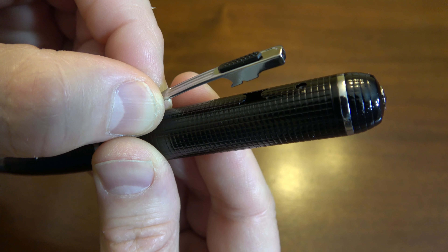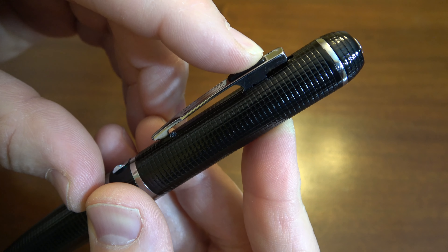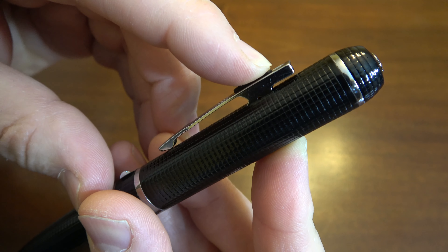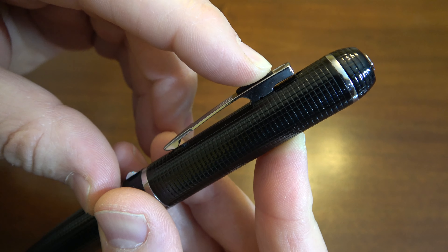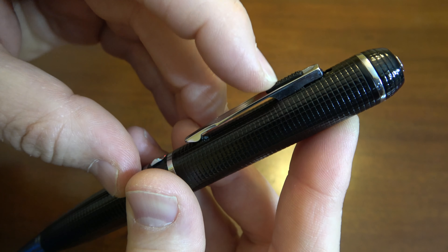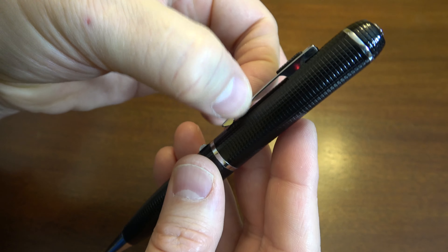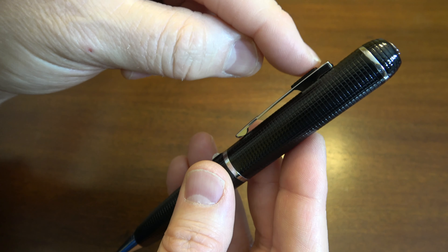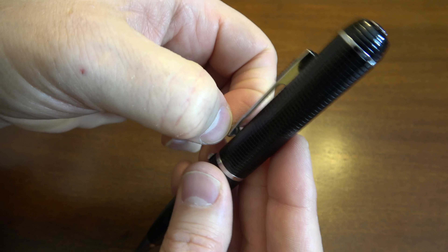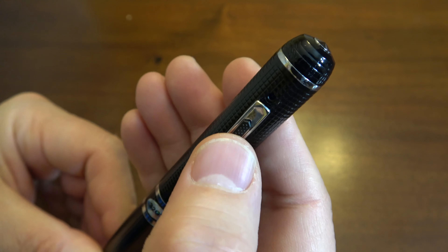Take the metal clip and the pen and set the clip gently into the rails where it's supposed to go — just right over the slot, holding onto it with tension to keep it in the right position. Now just push down on the metal clip. The metal clip is fully installed and it's no longer loose because we've bent the clip. This is a spring steel clip and we've bent it back in the proper position, so now we've got proper tension down here at the tip and the lens cover is nice and tight — it's not going to slide down.